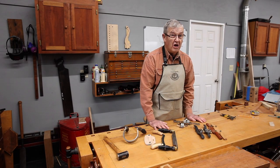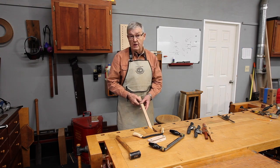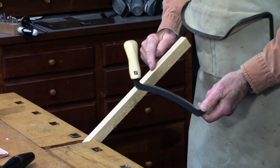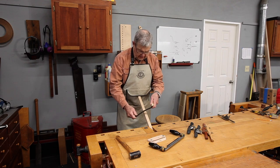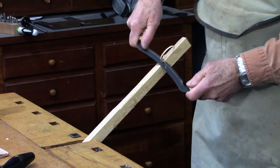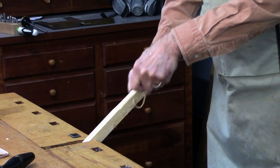Let's take a look at how these are used. Here I have a piece of ash in the vise — it's a hypothetical back spoke for a Windsor chair, a small spoke for a small wheel — and our object is to make this round. I'm going to start with this Flex Cut draw knife. I've read my grain carefully; it's running slightly uphill this way, so I'm safe to cut in this direction without splitting out. I can go in there, control that cut, making a little snap at the end. You can see you can move material pretty fast with this.